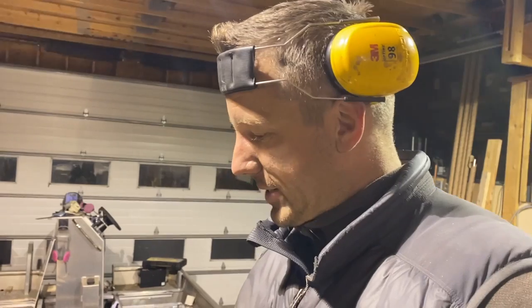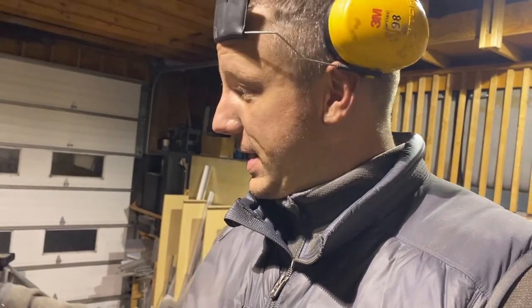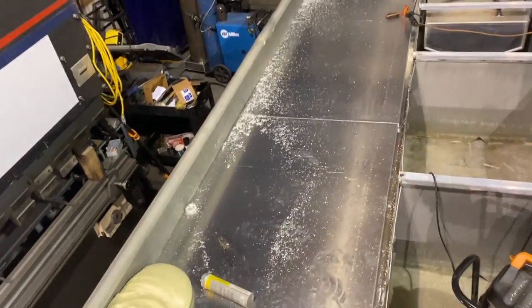I just went ahead and put in 2 gallons of mixed, 2 batches, and I just turned around like after 30 seconds thinking, oh yeah, it's gonna fill, expand that up nicely. And I realized that as soon as it filled up to the opening, it created air pressure because I didn't have a hole cut at the back of one of the chambers. So then it all just started oozing out like lava here, right? So I quickly went and cut another chamber at the back there. So hopefully it's expanding that way a little bit now.